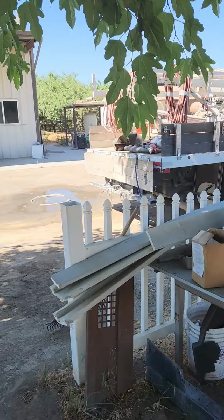Substrate, a nice base. The better it is, the better for your finish. That's just always how it works. It doesn't matter if it's brown coat, scratch coat, last coat. It all boils down. The better you have that lath on, the better you're going to get a scratch. And the better that scratch is more uniform, the better that you're going to have a brown coat.